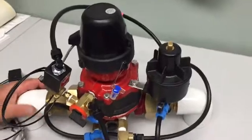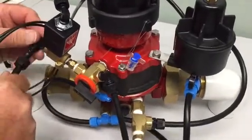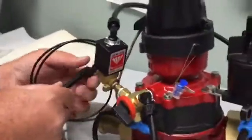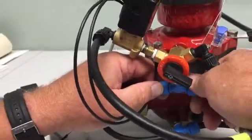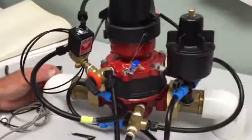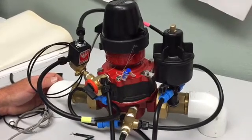We basically just switch those two tubes. The yellow tube that was here is going to stay in this position, but instead of being located on the second port of the pressure regulator, it now gets placed where the pink tube was — on the T at the bottom of the indicator selector. That completes the repositioning of the tubes and the change of the solenoid — all the things needed to make this device go from normally closed to normally open.